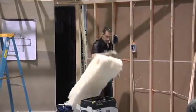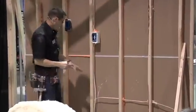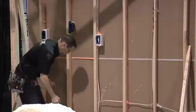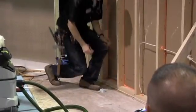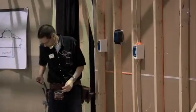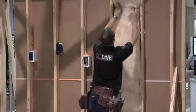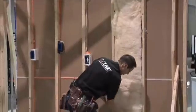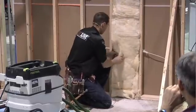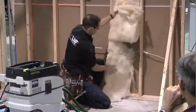I was asking Rick Arnold about it because he does a lot of this kind of work too. What he's seen done is before they hang the drywall or build the wall — they'll have a pile of two-by-fours and take a chainsaw and cut a groove right in the bottom of each stud, take a kerf right out of it. Then electrical wires just get fed through there so they're all down where it's easy to insulate around. But I didn't separate the insulation around this wire, so I've actually got to split this — and that's not easy and it's very little fun. Look at the lousy job I'm doing; it's hard to do right.